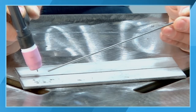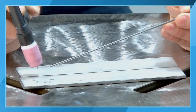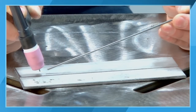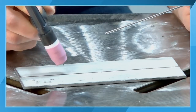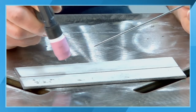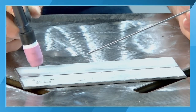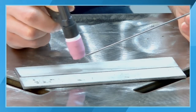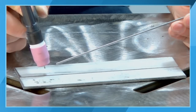So you would start your arc. And like I said, a common mistake that people make is they don't plan where they're going next. They typically will take their torch and move the torch like this. They also raise the torch up because they start running out of reach with their movement, or they aren't proficient at sliding their hand across, or figuring out how to pivot their arm and maintain the torch over the actual welding joint.